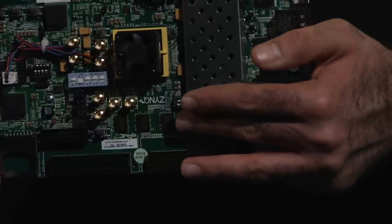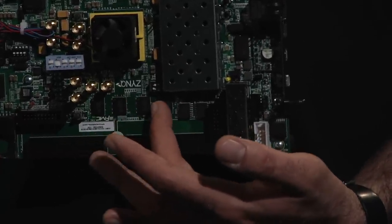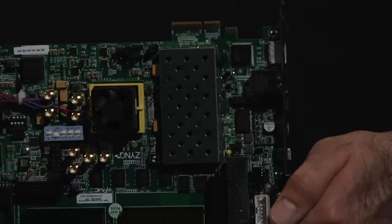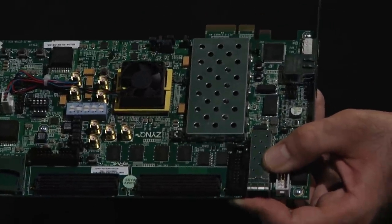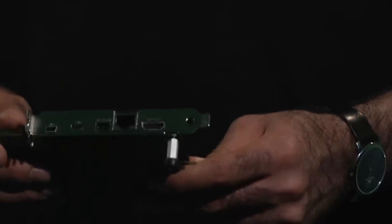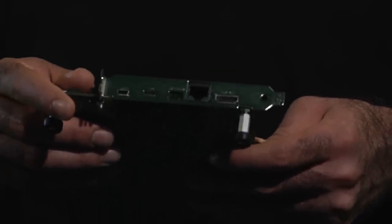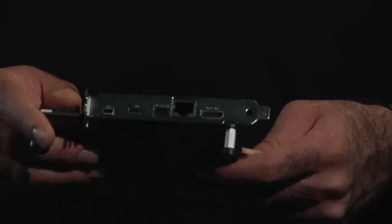The next set of DRAM components are here, and these are the DRAM components which are connected to the PS of the Zynq device. Then you have the programming interface — the same concept of having the JTAG chain with all devices inside it, using the JTAG chain to configure the hardware. The JTAG USB interface is provided on this side of the board. You have two USB connectors — one will mostly be used for UART and the other mostly for the JTAG interface.